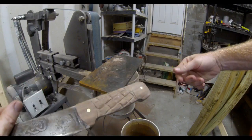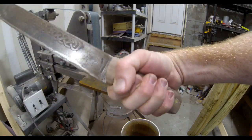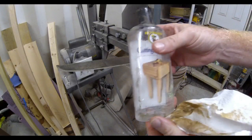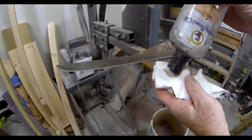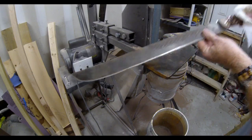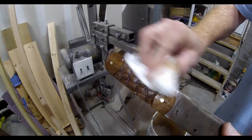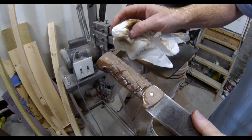The final step is to add some oil to those handles — that'll really bring out the luster of the walnut. Walnut is a beautiful dark wood that really shows off the detail of this particular handle very well, but you don't appreciate it until you add some oil. This is just a cutting board oil I had in the garage — you could use almost any oil, but this works out real nice. You want to give it a good coating, let it soak in completely, then wipe it off with a paper towel and give it another coat.